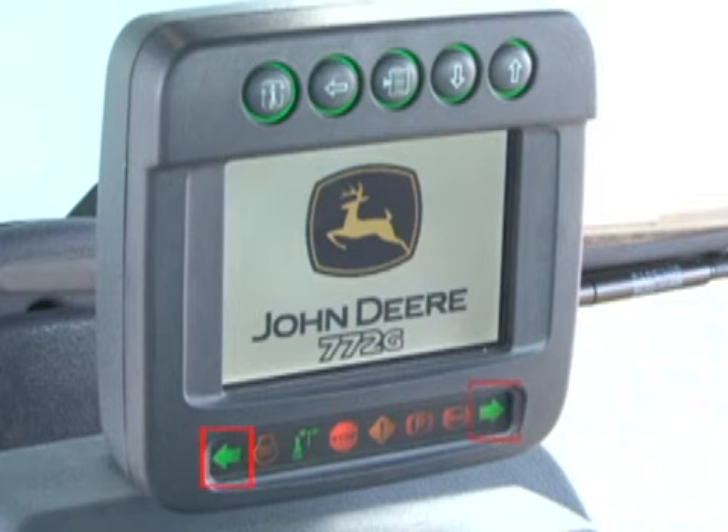The icons include the turn signals, engine heater indicator if equipped, lever steering indicator if equipped, stop indicator, service required indicator, park brake on indicator, and brake pressure indicator. If the service required indicator illuminates, a problem is developing in a system, usually also displayed on the screen — it is not necessary to stop the engine, but the cause should be investigated as soon as possible. If the red stop engine indicator illuminates and the alarm sounds, stop the engine immediately and investigate the cause.